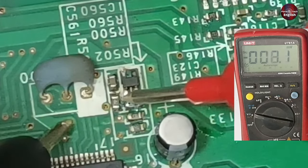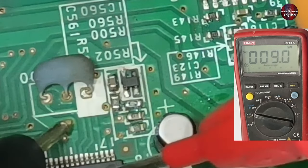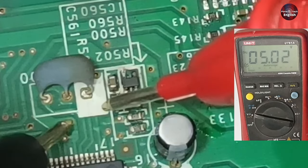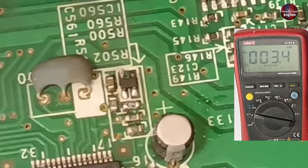Checking the second pin, we are getting 5 volts here as well. I will now check the voltages at pin 19 of the microcontroller — 5 volts are present here. The voltage detector voltages are also fine.